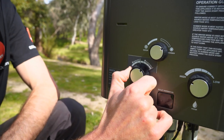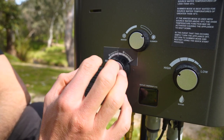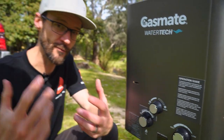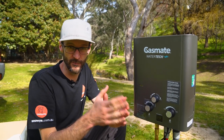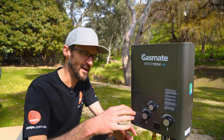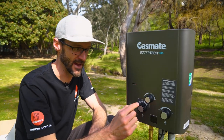The gas control has a minimum and a maximum for winter, and also a maximum for summer. Summer gas control can go all the way around, but winter will only go to a certain point. If you go any higher than that on winter, it's actually going to cut out because the temperature rating will go over 50 degrees. AGA gas laws require it to cut out at that temperature, so winding it higher would be illegal.